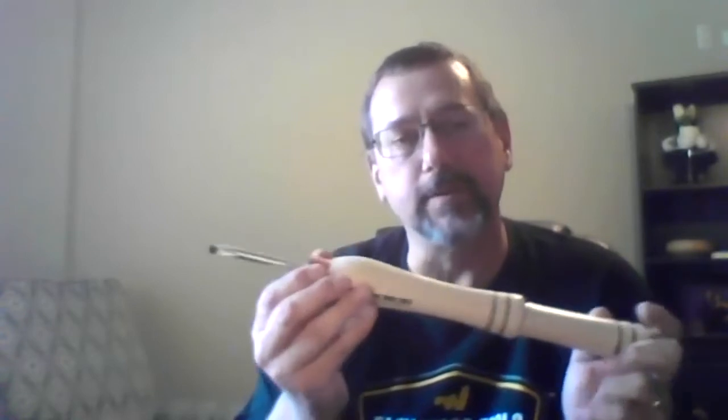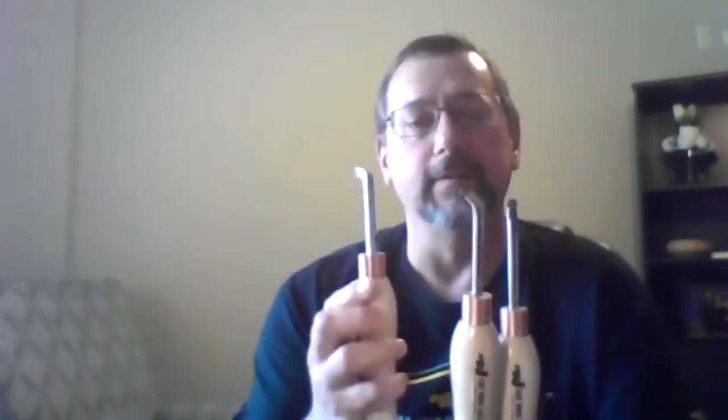And then what we also did with the new micro or mini hollowers is we paired that with the negative rake cutters as a standard. That also smooths out the turn inside of a blind opening, a blind hole. And when you're going in with the hook tool, it minimizes the catches that you can get with a hollowing system and gives you a much smoother turn.